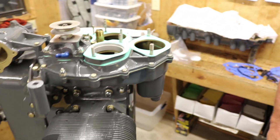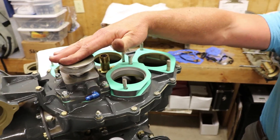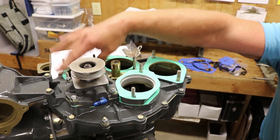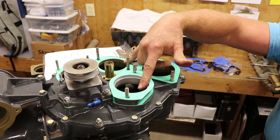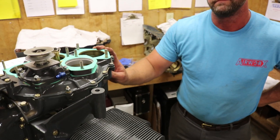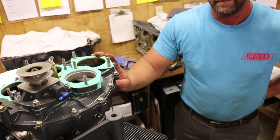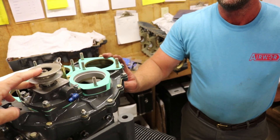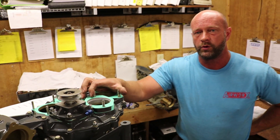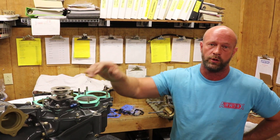This is the accessory case. This is the alternator drive. The Cessna 172 conversion does not have a fuel pump, so this one gets blanked off. You get your two magnetos and then also your starter. Comparing the six cylinder to the four cylinder — they also made a four cylinder — they all have the same accessory case. The alternator is available geared or not; on the four cylinder you can put a generator on it or an alternator that's gear driven, or one that's belt driven.